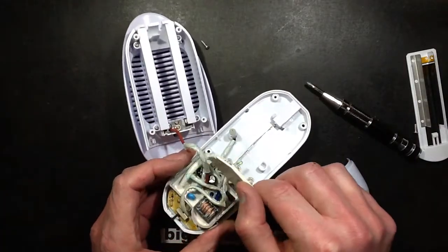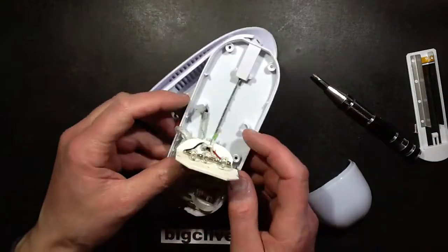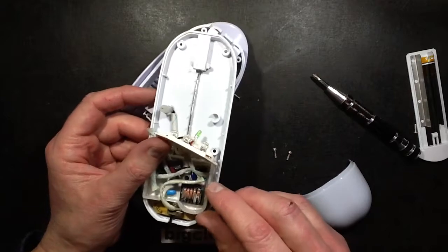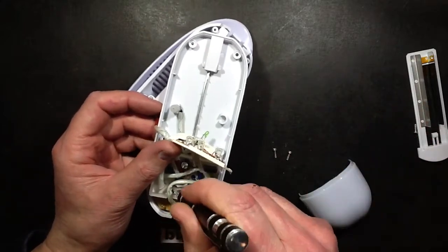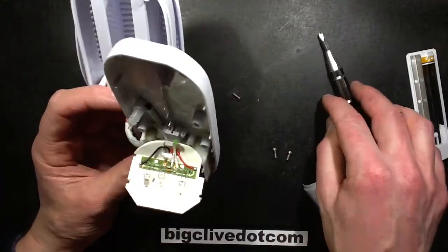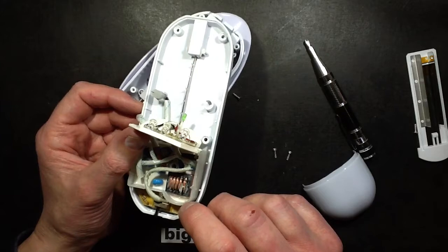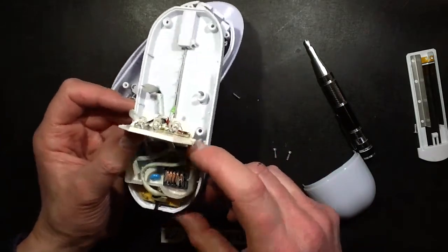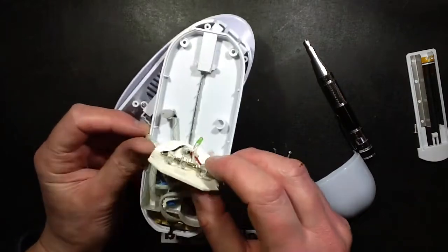What's it stepping the voltage up with? It's a step-up transformer. I wonder if it's discrete components or if it's actually got a switch-mode driver chip — it's potted in hard white resin, so that's not going to be very penetrable. It's not the piezoelectric. I guess that may be a drive transistor, then the step-up transformer, and then a voltage multiplier to get the higher voltages.